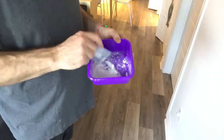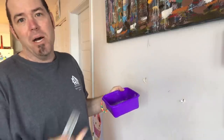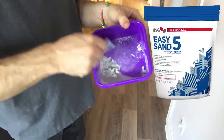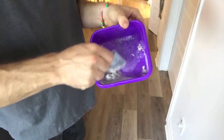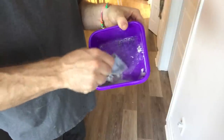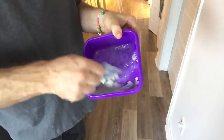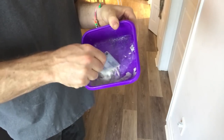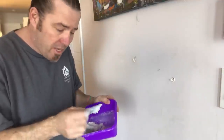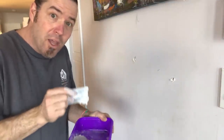I've got my five-minute mud and my Visa. I'm gonna go ahead and mix this up. Every homeowner should have five-minute mud. Just gonna mix it up nice and gently with some water. You want to mix this up a little thick so it's pliable — you can put it in a hole and it won't run out. You can tell because it won't fall off the card.